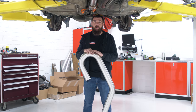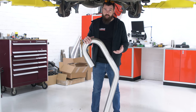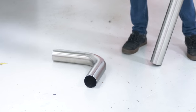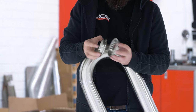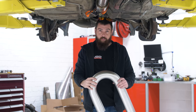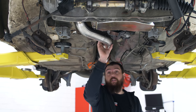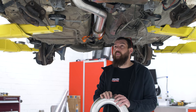For the exhaust, I'm doing all 3-inch, and it's all stuff available in our universal exhaust catalog. We have UJ bend setups, 90s, 45s, and V-bands in 2.5 and 3-inch options. These are nice V-bands that have a piloted step so they center when you put them together, unlike cheap V-bands that walk all over the place. It's the most affordable stuff on the market, all 304 stainless, and really nice to work with. I've gotten from the turbo — I made the downpipe and then a straight section to a little resonator, though I think I'm going to use a different resonator and move this one elsewhere.